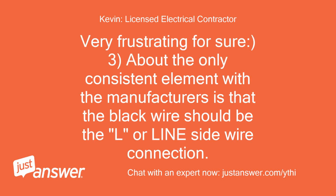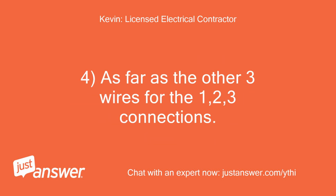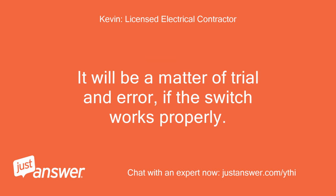3. About the only consistent element with the manufacturers is that the black wire should be the L or line side wire connection. You can confirm this using an AC voltmeter and see if it is 120 volts from the black to a ground wire. 4. As far as the other 3 wires for the 1, 2, 3 connections, your guess is as good as mine, since they never document or show a schematic wiring diagram. It will be a matter of trial and error, if the switch works properly.